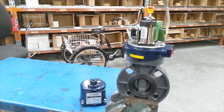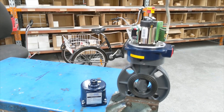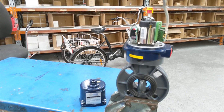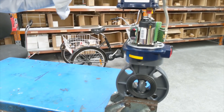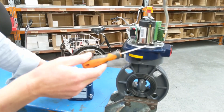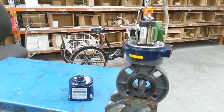Back to open — we're looking at about another 10 to 12 seconds. You'll hear that micro switch come up — it's cutting out now. As I said, usually this housing would be on top. You've got a visual indicator here, and you also get extra limit switches — voltage-free end-of-position open/close feedback, something like that.